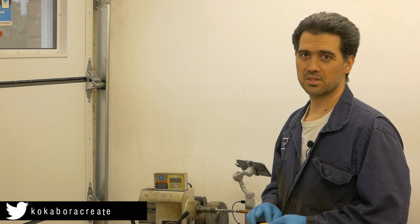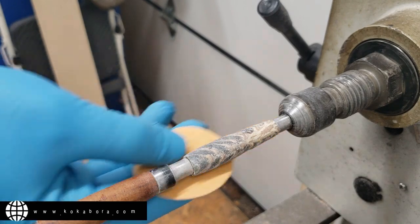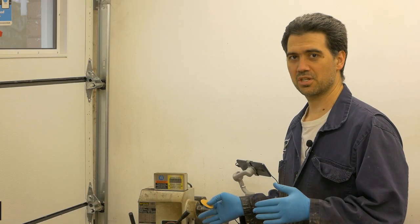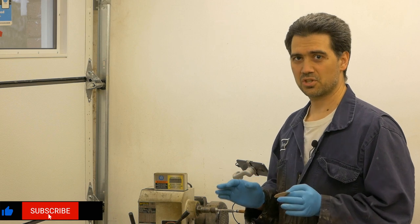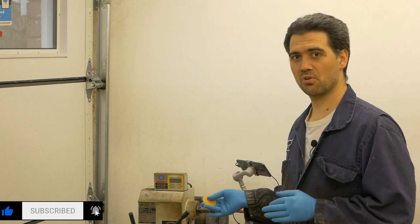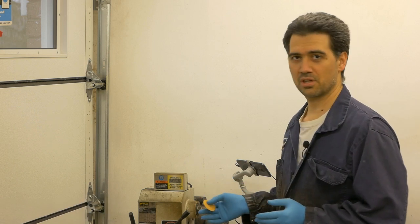Let's do a demonstration of the tool. There are primarily two methods of sanding on the lathe. One is taking the sandpaper in your hand and moving your fingers as quickly as possible along the grain of the wood, so that it matches the speed of the rotation of your spindle. That is important so that you don't get deep scratches or sand certain areas a lot more just because you held your hand in one place for way too long. Here is a little demonstration of what I mean.